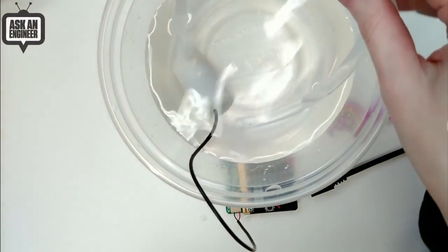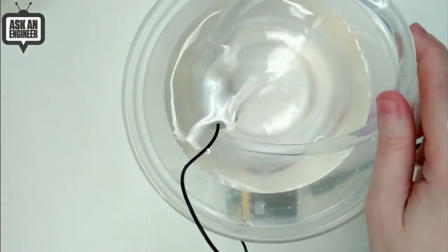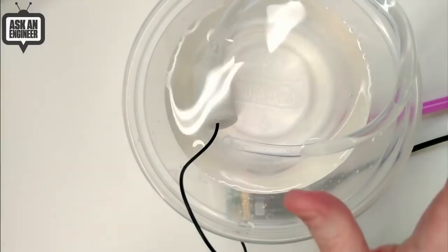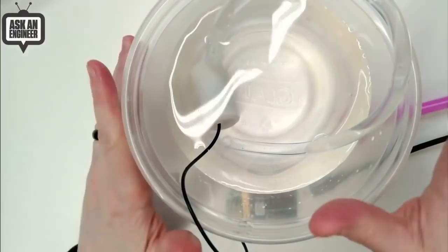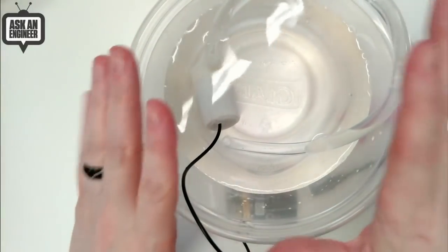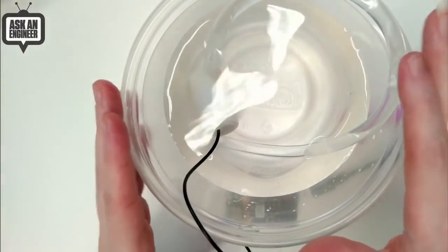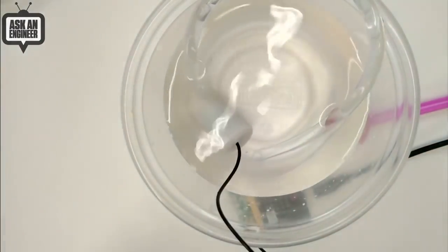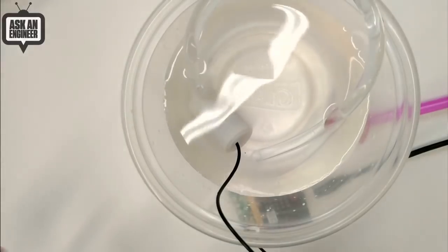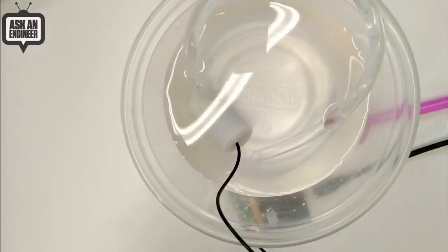So good for making fountains and plant watering projects, but not good for water that you're going to drink or anything that's not water. Don't put it into soda, lemonade, or alcohol. If you want to do projects where people consume the liquid, use our peristaltic pumps because you can use food-safe vinyl, and the liquid doesn't go through the pump itself. We have two types: a vertical type and a horizontal type. Basically it depends on how it stands — they're the same pump, just the plastic is a little different.